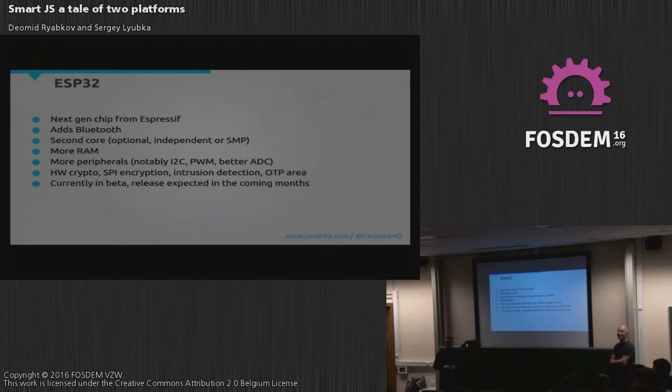Any other questions? I had a question about the SPI you mentioned. On the ESP, there is one flash chip. The ESP-01 had 512K, and the new one has 4 MB. You said there was a difference between the SPI mapping on the TI and the ESP. The SPI mapping I refer to is when an address in a certain region gets transparently mapped into a region in the SPI flash on the ESP, which is quite handy. We do OTA updates that way, so we keep two separate images. On TI, there is nothing like that.